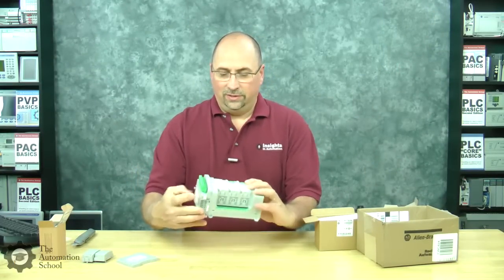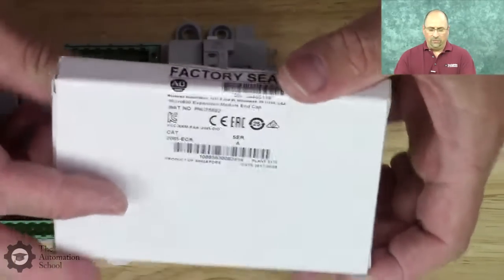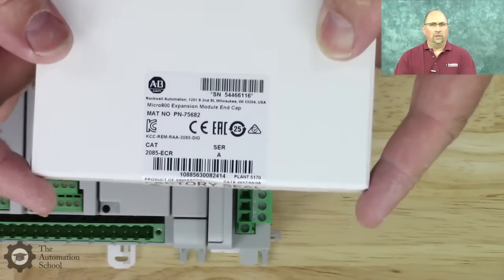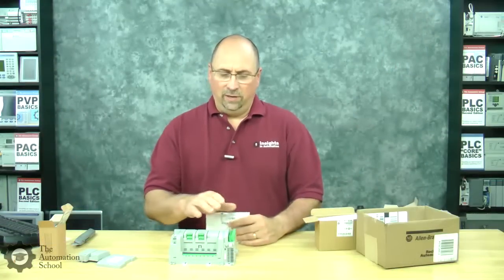What a lot of people forget to do when they have one of these is they don't buy an end cap. You don't need an end cap for the MicroLogix 1200, or the L16, or Point IO, or Flex IO. But you do need an end cap for the 1769, and you do need an end cap for the 2085 IO. The end cap is super inexpensive — it's probably just a terminating resistor. List price is about $15. It'd be nice if they included it, like the L2 series compact logics do, but I guess they're trying to drive price out of everything.